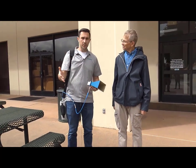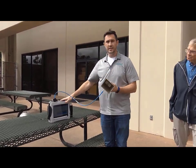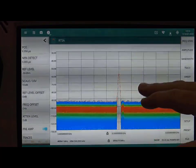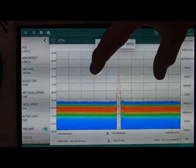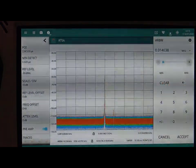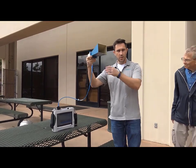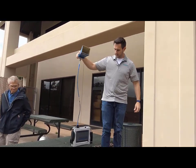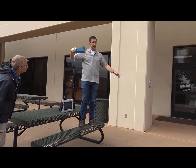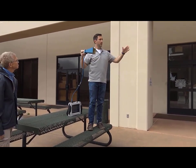Tom's activating the interferer. We're outside and we're going to see if we can find it. First thing I'm going to do is set up the instrument. I'm going to utilize my RTSA, my real-time spectrum analyzer. With the RTSA, it gives me the opportunity to zero in on the signal and understand a little bit more about where the frequency is and the characteristics. If the signal is a CW signal, I know I can narrow my span when doing my search, which can speed things up. If it's a wider band modulated signal, I need to use a wider span. As I look here, I'm taking my antenna and pointing it in different directions. One thing you might want to do is get to higher ground. As I'm pointing, you can see the signal on the screen. I can see I'm seeing a lot of power in this direction. So I'm going to go ahead now and switch over into my interference hunter mode, my interference finder mode, and see if I can find the signal.